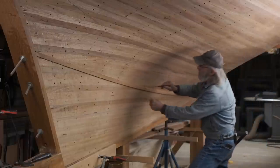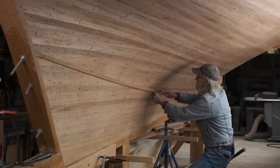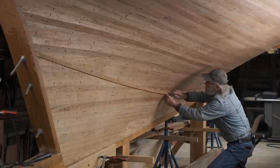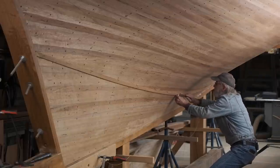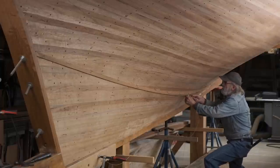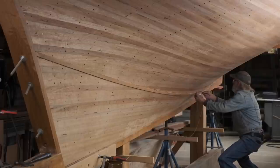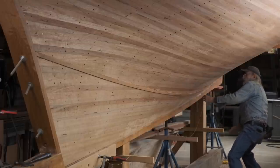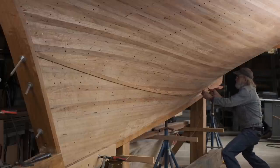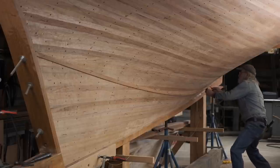What I'm doing right now is I'm drawing a line below our magic line, up forward on the boat from amidships forward. It's five inches from the magic line. We're going to put parallel planking on it from amidships forward, and that just means that the plank will be ripped to five inches. It'll have to be edge set onto the boat, but very, very slightly, because close to it, adjacent to it, is our magic line, which is a straight line. So even though we'll get a slight edge set down in this area, it will be very, very slight.